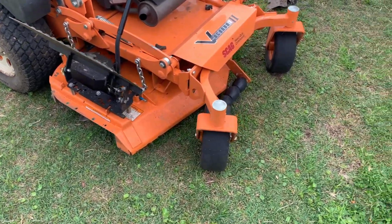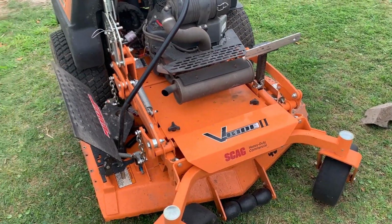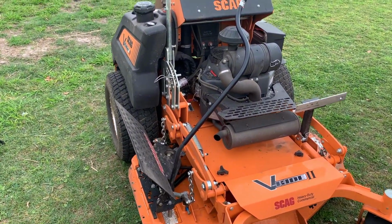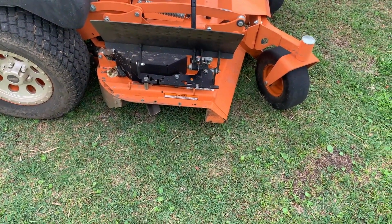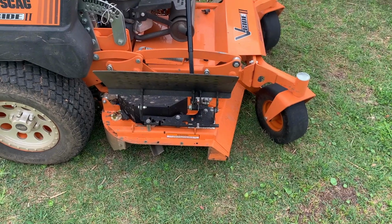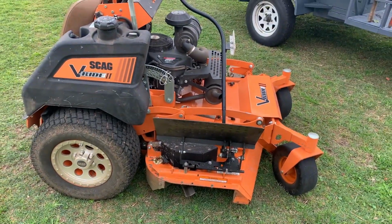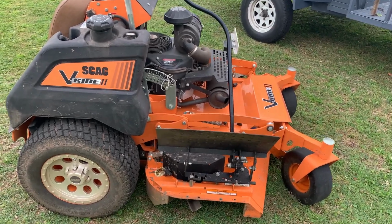Now, in all honesty, I do have a problem with some blowout. Down here in Australia, we mow very low, and we don't typically have a leaf season in the way that some areas in America have it. We have leaves all the time, so different sorts of trees dropping leaves all year round. What I've found is when we're using the Catch Pro here, this big opening performs really well. This mower can cut through even the toughest conditions, but we do get a little bit of that blowout, and I have corrected it by pitching the deck 5 mil at the front and lowering the baffle. That has really helped me, and some people on Scag Nation gave me a heads up on how to do that. So that's been really great. However, there is still a little bit of that blowout, but it's not anything to cry about.